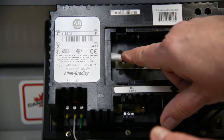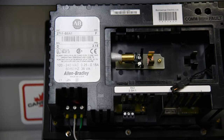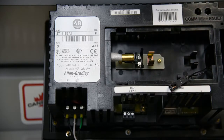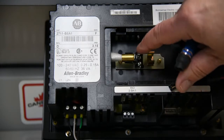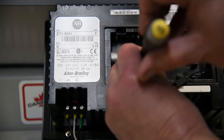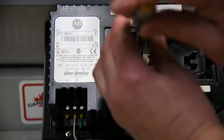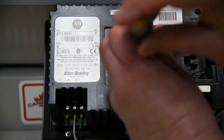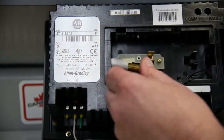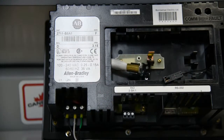Now, here's our bundled fiber optic lines that go to the front screen. When we grab our LED replacement — which is this guy right here — the end of it has a piece of heat shrink on it that's sized for this. What you want to do is take this little plastic clip out. Take a small screwdriver that fits into those slots and take this out. It comes out quite easily. And remember to be careful with the screws — don't drop them, because if they drop inside, you'll have to take the entire unit apart.